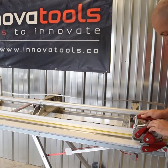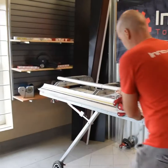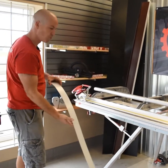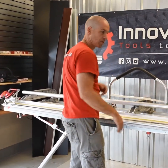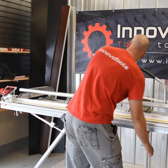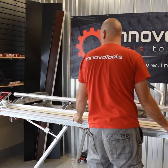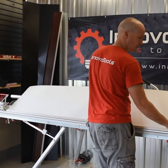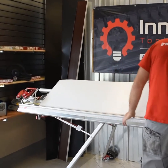Whenever you're ready to make another cut, you can leave the cutting tool on the brake — simply rotate, pull down, rotate the other way, apply downward pressure, cut through the material. When you get to the end, the assembly goes back to the neutral position and out of the way. Now we have our one inch offset, so if you want to do a return bend or a full crimp, you can bend it without interfering with the cutting tool.